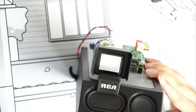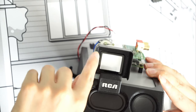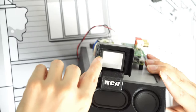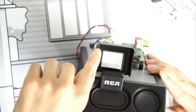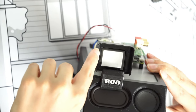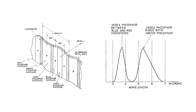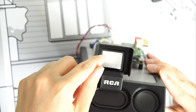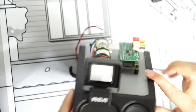There is no grid, no shadow mask or aperture grill or anything. It's just the stripes of phosphor on the screen, vertical, like it would be, for example, in a Trinitron with stripes, but no mask here. And after the colors, there's RGB, but also UV. There is an ultraviolet stripe as well, and every time the beam scans and hits the ultraviolet stripe, this is actually a sensor.